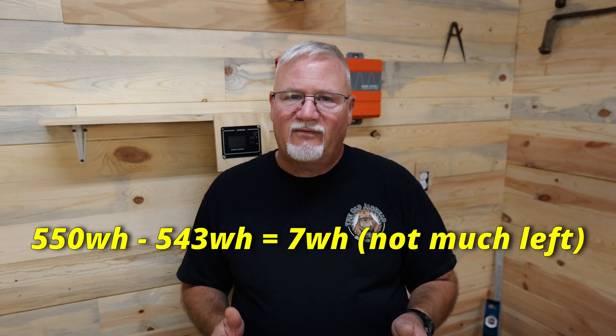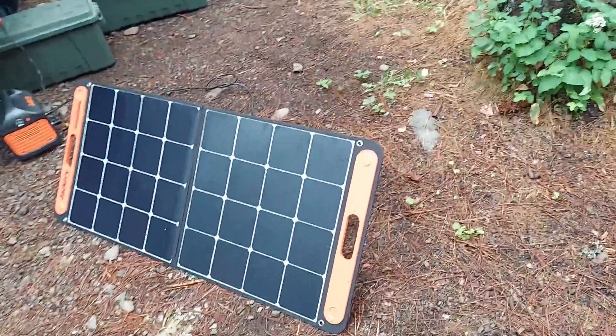When I tested this, I found that running my CPAP the regular way I use it — off the 12-volt side, with cellular on and the humidifier and climate settings all on — I used about 273 watt-hours in a seven to seven-and-a-half hour period. CPAPs do use cellular often to communicate back to a central server. That tells me that if I ran my CPAP for two nights, the Jackery 550 will in fact run it for that period, though it'll be pretty much depleted. A solar panel to recharge during the day would help significantly.